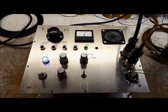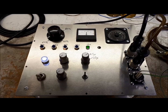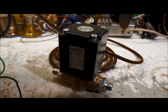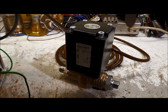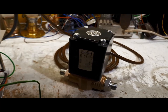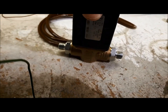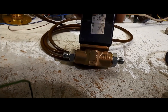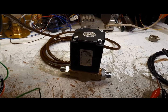I'll leave that switch in the upper state. The valve is fed with a pulse width modulated signal arranged at a frequency that allows the valve to resonate, which helps prevent stiction and aids in smoother proportional control of the valve. The valve has a 24-volt coil and the direction of flow is marked on the valve casing. The valve has a small orifice inside which varies in size, and the flow of fuel through it varies as the valve opens and closes under electronic control.